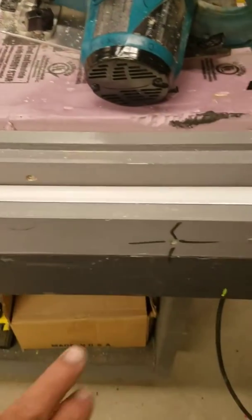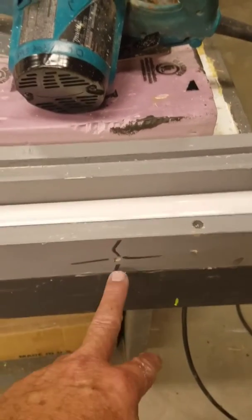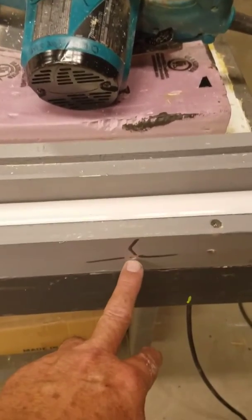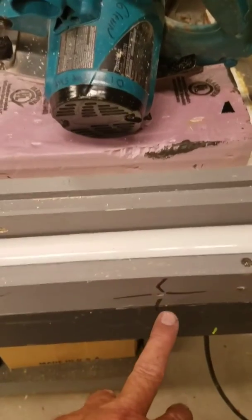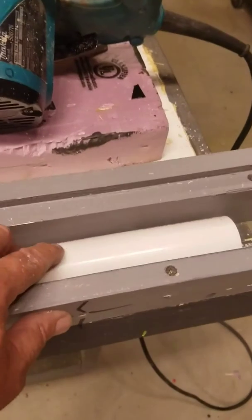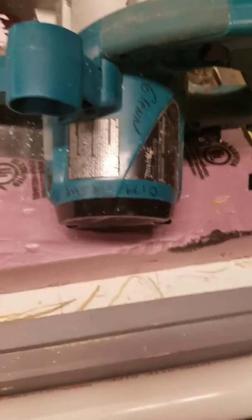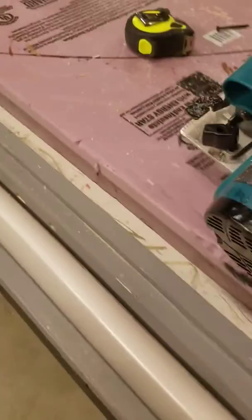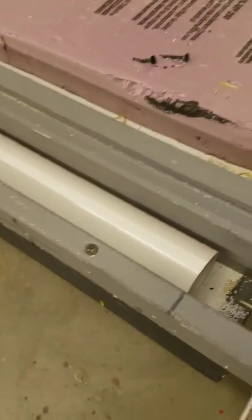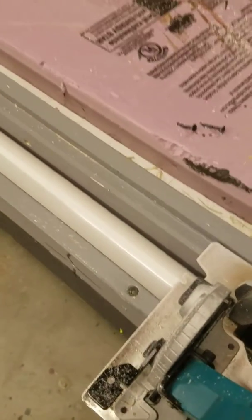On the sides I've created a couple areas. I've marked these out so I know where to go as I'm putting pipe on, and I'll be able to put a screw in here. It self-taps into the pipe itself and holds it tight so it doesn't bounce around as I'm sawing it. So once it's in place, I take my power saw and go through and cut it. Be sure to wear a face shield.